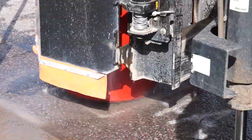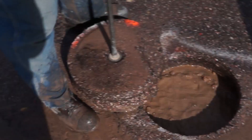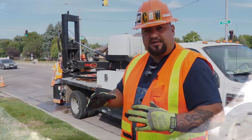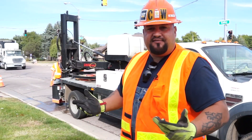There's an 18-inch bit on this truck, and what we do is we actually drill the asphalt and remove the 18-inch core. It's actually a cost-saving thing, so we can do our work and get a visual on our pipe through an 18-inch core compared to open digging with a backhoe and having, say, a 5x4 cut.